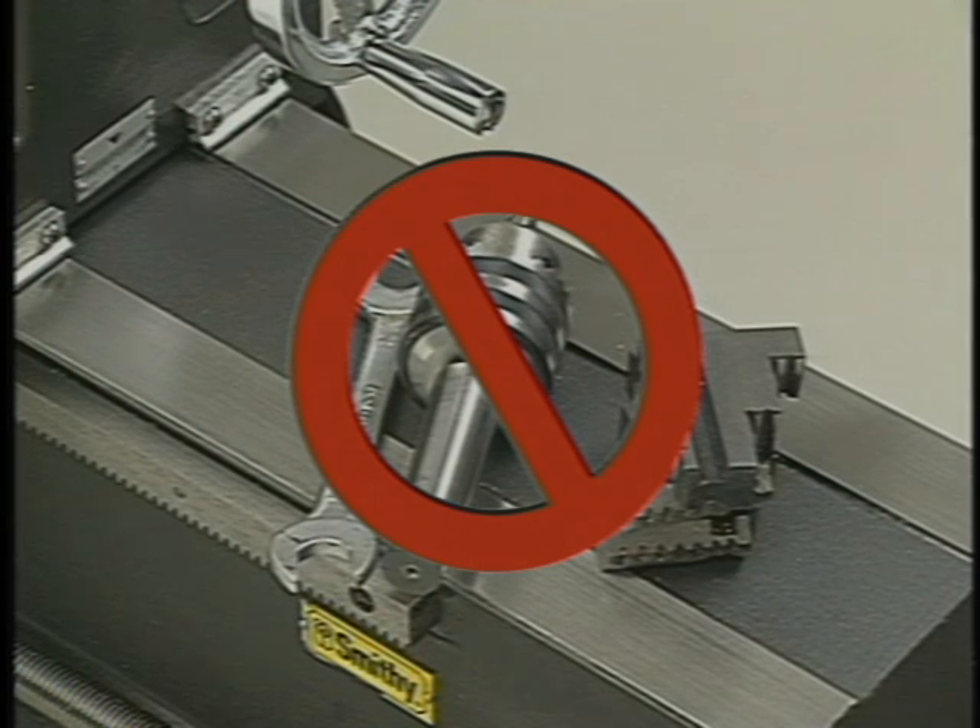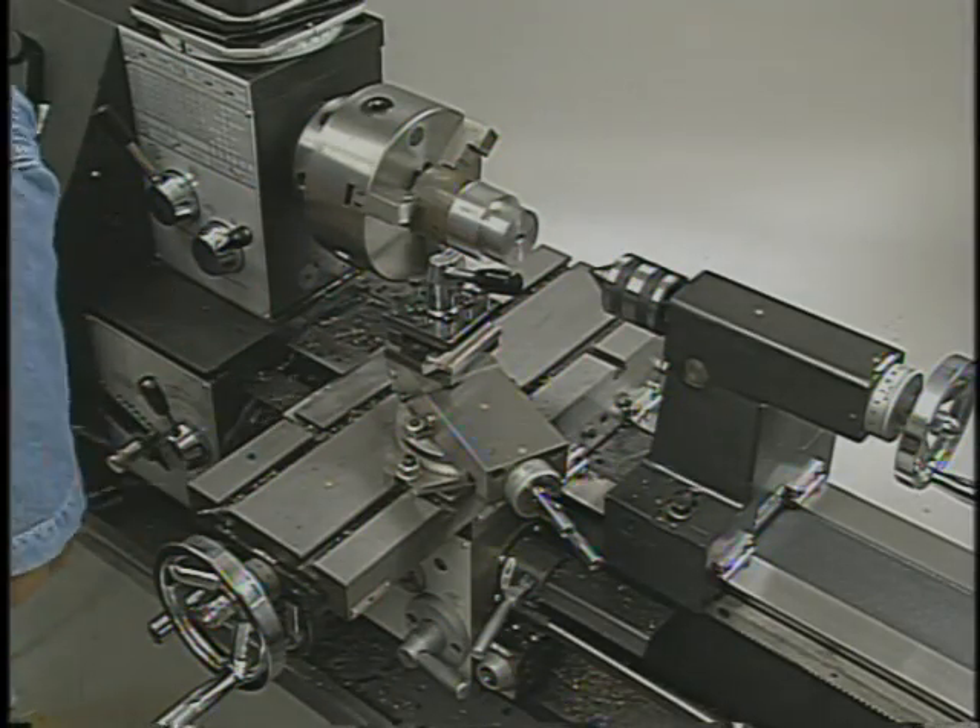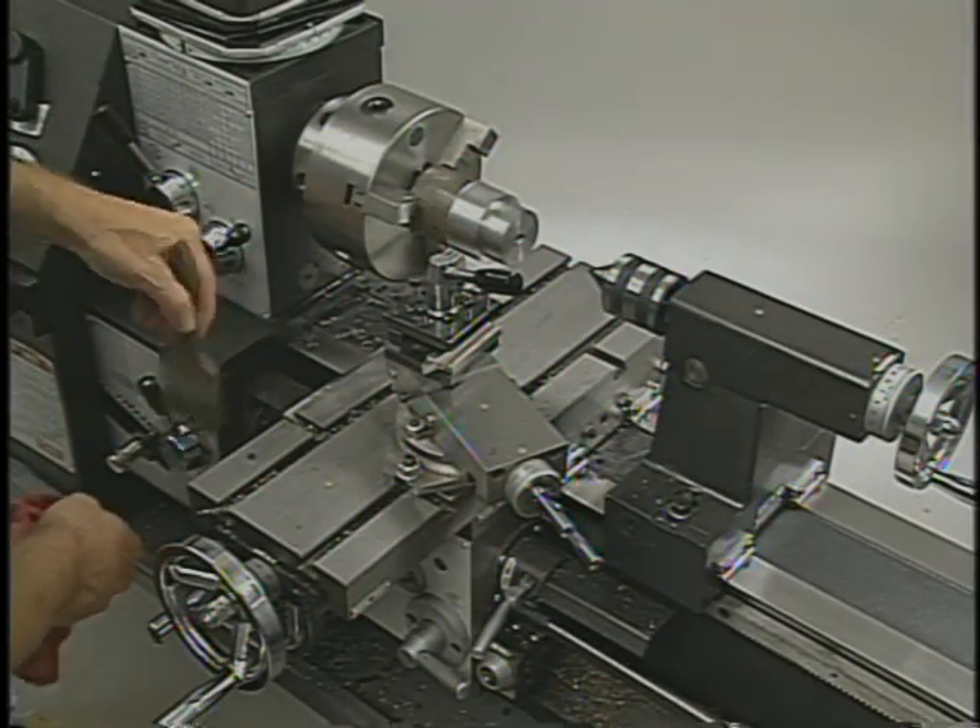The ways are not a shelf for your tools. Keep your tools off the lathe — put them on another table or on a shelf below the lathe. Don't put tools on an open shelf above the machine where they could vibrate off and fall onto the ways. It's also very important to clean away metal chips as your work progresses.